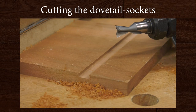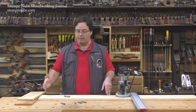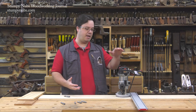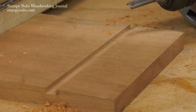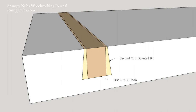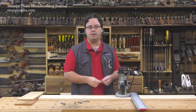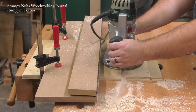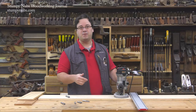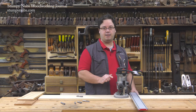Unless your workpieces are very small, it's unlikely your router table has the fence capacity to cut the dovetail shaped sockets in the face of your panel, such as on the side of a bookcase or cabinet. So this task falls to the handheld router and an edge guide, much like a dado. Many sliding dovetail sockets begin as dados — the first pass is made with a straight router bit no wider than your dovetail bit's neck to remove most of the waste, then you follow with a second pass of a dovetail bit to complete the shape. This reduces stress on the narrow dovetail bit and aids chip extraction. The good news is you don't have to move your edge guide between these steps; the location remains the same for both cuts.